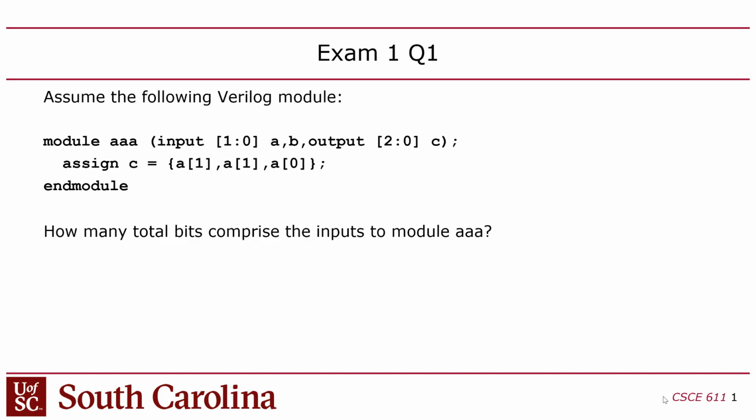Yeah, I saw some other groups that tried that. If you take the RAM that's in your register file, the memory, I think we called it mem, or regs, or whatever, and you make it a port, that port would end up being a RAM port. It's a 2D port. And as far as I know, you can't output a RAM as a port. I don't know how to do it, let me put it that way.